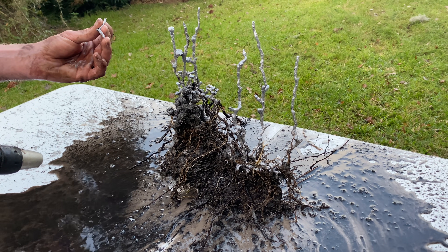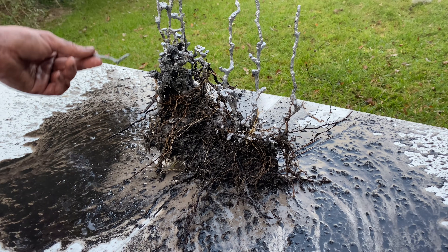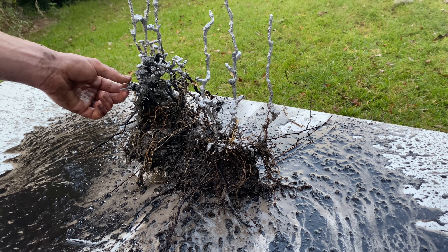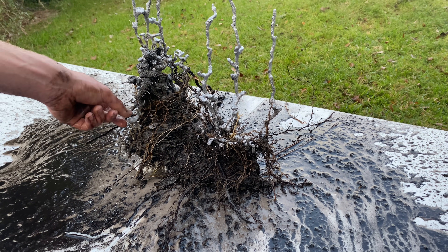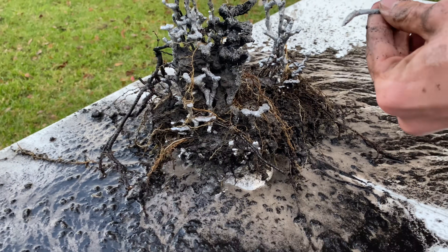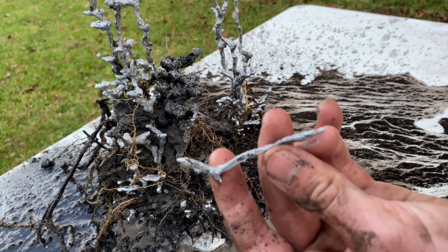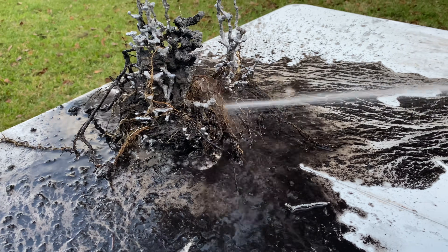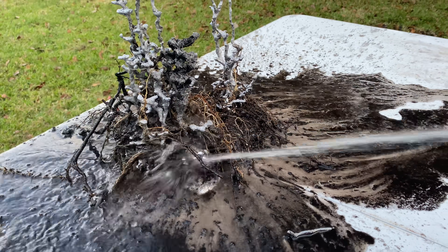The reason this area is all messed up over here is because all that steam came up very violently and just didn't allow the aluminum to come in as a solid piece. So this section is very thin — just like a shell of aluminum. It's pretty interesting. The rest of the casting looks like it's done very well though.